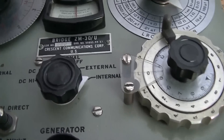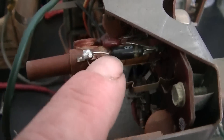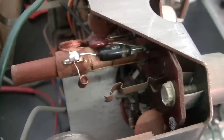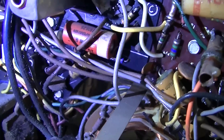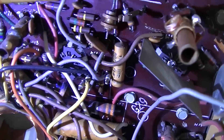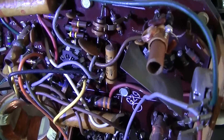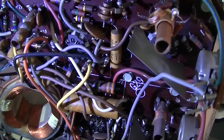There must be different frequency sets. This diode in this set measures 300 millivolts one way, open the other way, so the one in the Hotpoint is definitely different. This GE set is a bit different — you can see it does not even have the phase detector diode. There are a lot of little differences between this set and the other one; it doesn't have the 2.2 either.